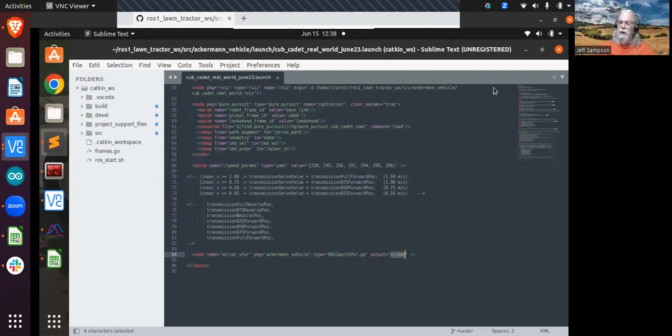But it'd be very good to know if you are telling that servo to do something funny, instead of guessing that, well, maybe it's current or something else, look to see if you're actually telling it. If you're telling it a constant speed or a constant position and it's changing, well, then yeah, it's probably something mechanical or over current or whatever. But if your code is telling it to change speed for whatever reason, then that's going to save you a lot of time instead of trying to track down all this other stuff.